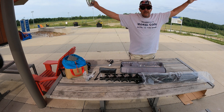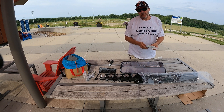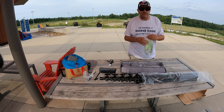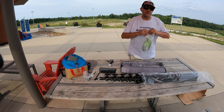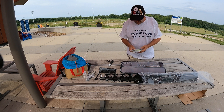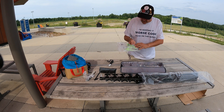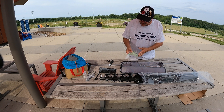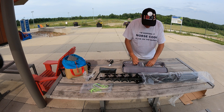Set up about 16 feet as an inverted V, that'll give you omnidirectional results. One of my favorite portable antennas is the 40-meter inverted V — no problem working 500 to 800 miles out and even some DX stations. Here are the 40-meter wires: well built, very rugged hardware, stainless steel, with paracord included to keep everything isolated.